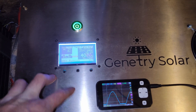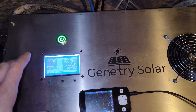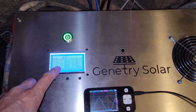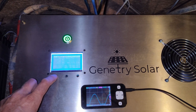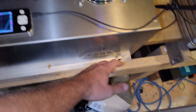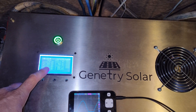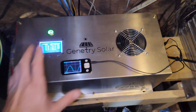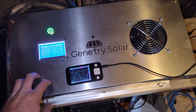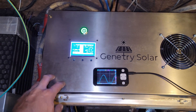I am running this inverter at a much higher voltage than it was designed for. It does support higher voltages, but they said the FETs may get warmer than usual at higher voltages. Temperature is now at 117°F and those fans are really ripping — the amount of air coming out is insane. This is not a quiet inverter when you're pulling lots of power, but if it can keep this up I'll be happy.